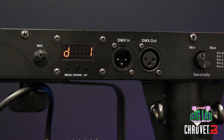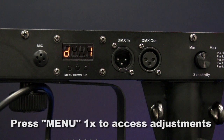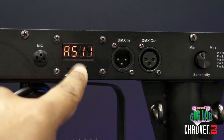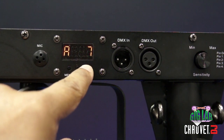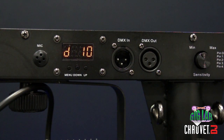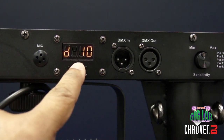If I want to change the channel, I'm going to hit the menu button one time — because I'm not changing modes out of DMX, I just want to get to the next level in the hierarchy, which is addressing. That goes to 'A' and I immediately press down or up. I want to change this to DMX address 10, so I let it sit, and you can see it's now DMX 10. Whenever you let a menu option sit for a couple of seconds, that's what it sets to. Now if I press up or down, it's not changing.